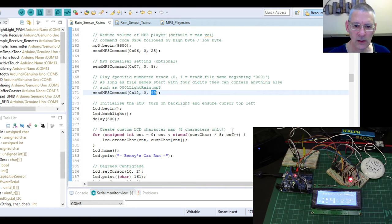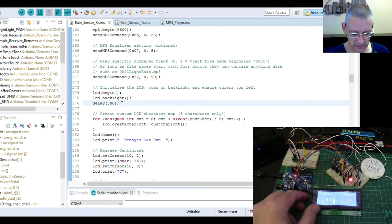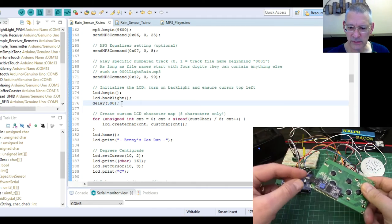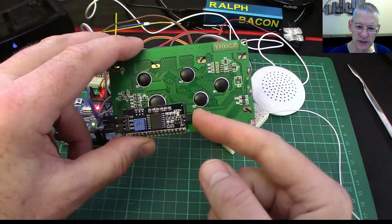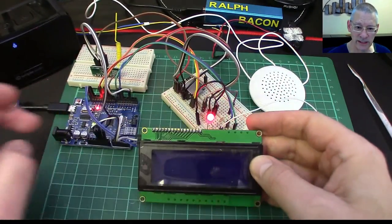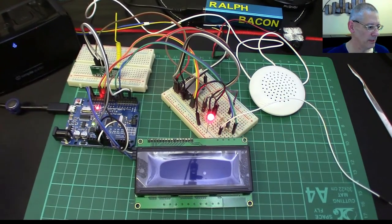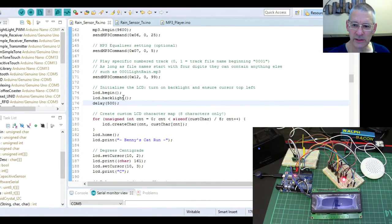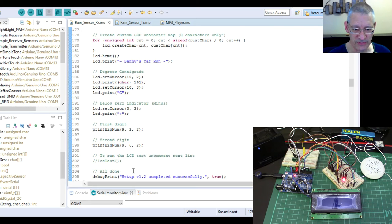The backlight on this LCD can be switched off via a little jumper or done programmatically. You can call backlight() and switch it on or off with true or false. What I want to do is flash the backlight to draw attention to a problem without being noisy. Then we load up the custom characters, print a few things to the screen initially, and we're ready for the main loop.